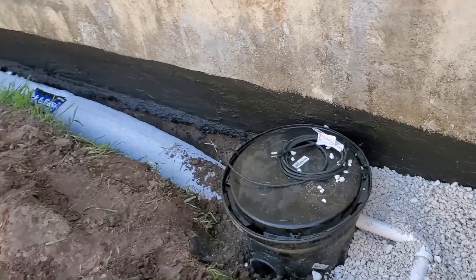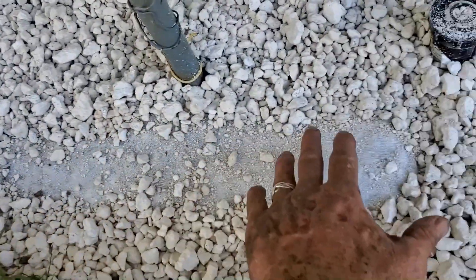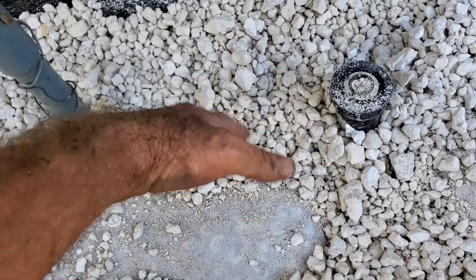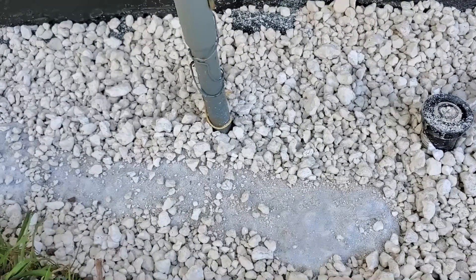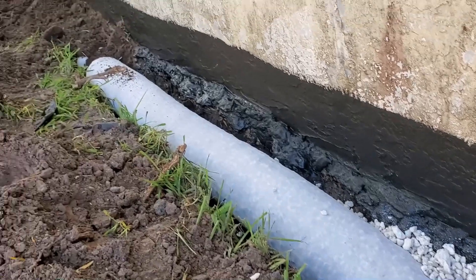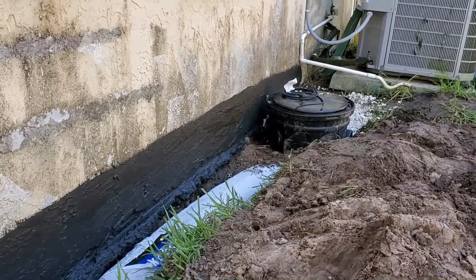This is a sump system that's going to lift the water up from the footer pipe. Remember how the gas line and irrigation were there? We turned our footer pipe and went around the side. You can easily add gravel between the footer and the pipe — it's going to allow that water to flow right over to your system and be carried away. We just put it down to move the water over to the footer pipe, which is already wrapped. You can see we're right at footer level, and here we're backfilling. What a great project for the do-it-yourselfer — this is something you can do and save truly thousands of dollars.